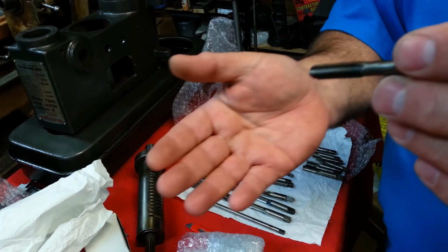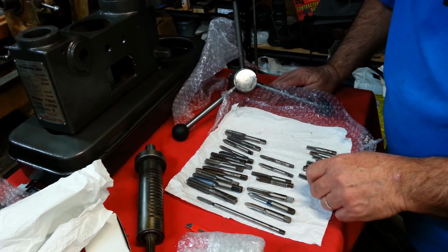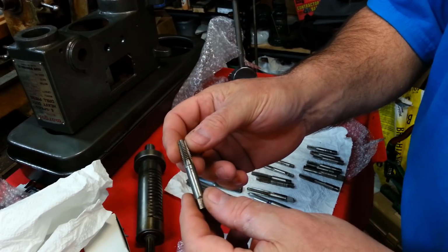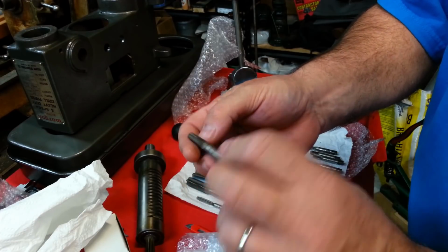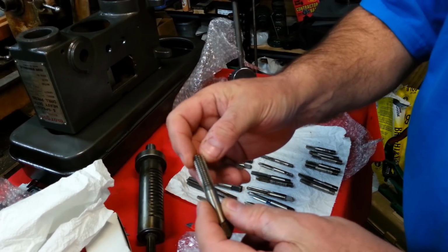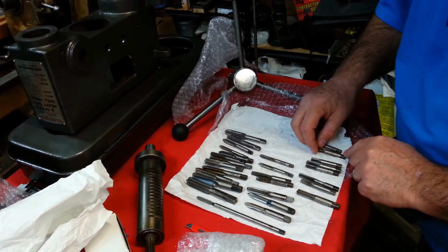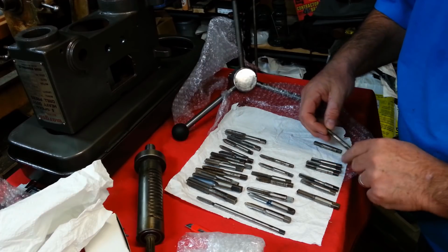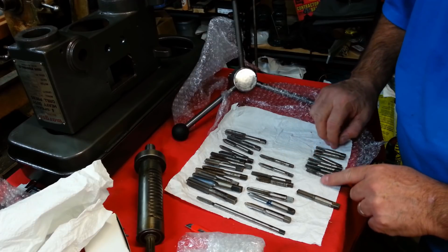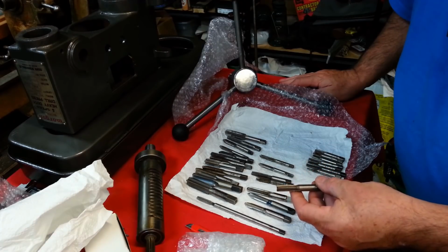So this would be a tap you would run down in a hole after you had tapped it with a standard tap to try to finish one or two more threads in a pocket hole, one you can't get the tap through. And if it's possible to regrind or resharpen a tap, these look kind of interesting. In contemplating doing this, I never thought that it could be done to look that decent, but I can tell these are old, more worn taps that somebody's done this with. Interesting. And we got a lot of duplicates here in these cut down taps. So 5/16, what's the course? 5/16, 18. These are, all of these here are 5/16, 18. And this one is a 3/8, 16.